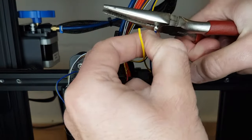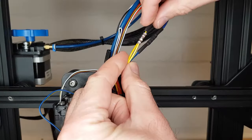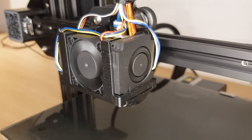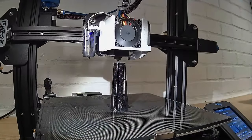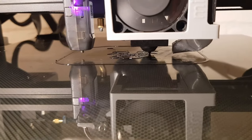You can simply solder them for the smallest profile, but if you can't or don't want to solder then you can use crimp terminals. They do a similar job but are much cheaper and easier if you can't solder. Wire both part cooling fans in parallel, or if your printer supports it you may want to wire to an additional fan plug on your mainboard. Just ensure that both fans are turning on together and are running at the same kind of speed. After initially installing the single fan option out of PLA plus, I used this setup to print out a dual fan option in PETG. I wanted to use a filament with a higher melting point so there'd be a little more heat resistance. However, the PLA plus stood up fine to the 240 degree hotend temperature I used to print the PETG so it's probably fine.